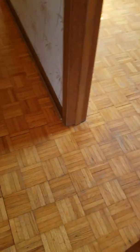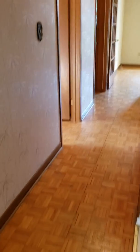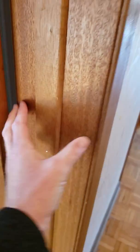All of the trim is coming out in the whole house. For the baseboard, we're going to put a new baseboard, probably a square, rectangle, straight cut, modern trim with some kind of extra step to replace quarter round. I just don't want those round edges, so we're going to keep it square and modern. Same with around the doors. But all the doors themselves are going to be custom pre-hungs, custom measured to the width of the door jamb, plus the height and the width and everything.